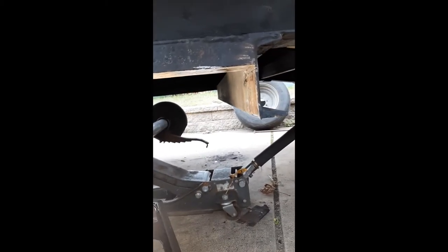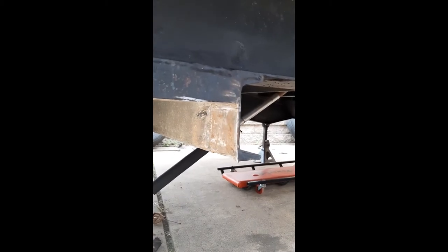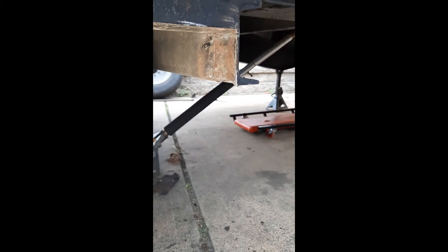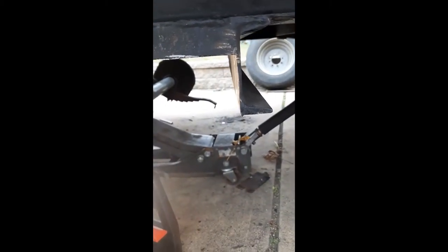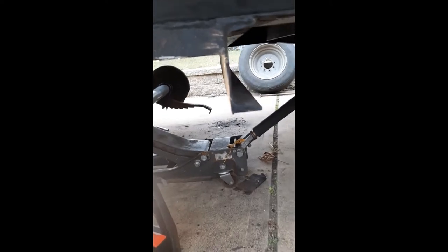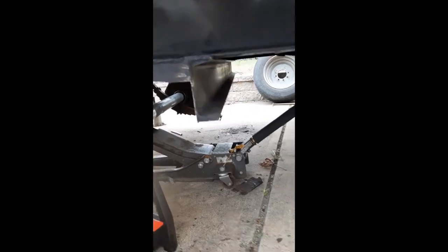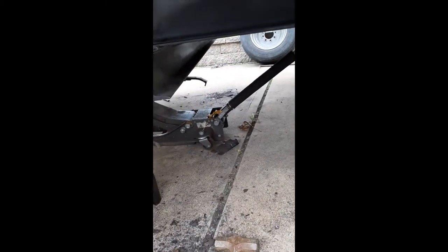I got both of the hangers off — this one and then the one down on that side. I got it cleaned up pretty good, probably hit it with the wheel one more time. I grinded them and had to use the good old persuader to get them off. I probably could have used the plasma cutter, but I was trying my best not to mess with the main metal, the main steel. And I'm not that precise with the plasma cutter — I've used it, but I'm by far not a professional. So I went with the grinding method and it didn't take that long. I probably spent an hour and a half getting them off and getting this cleaned up.